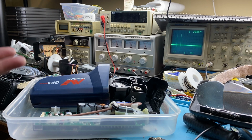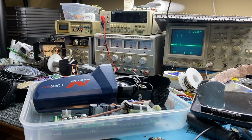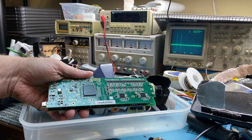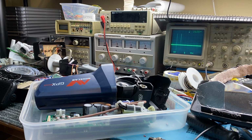And it's what actually happens. It happens in other detectors too. It sets up a feedback loop, and the detectors go off their nut. It just starts screaming and carrying on. It won't settle down. I haven't gone into great detail finding out whereabouts those inductors live in the circuitry. I'd say it's something to do with frequency control or part of the oscillator, something like that. What else could it be? I don't know. It's got a Class D amplifier in it, and that's part of that. I don't know what is around there. But some other areas of this tend to be a little bit microphonic, and I've got some parts on order to clean that little part of the circuit up as well. Should improve the performance.